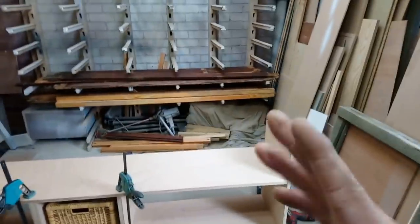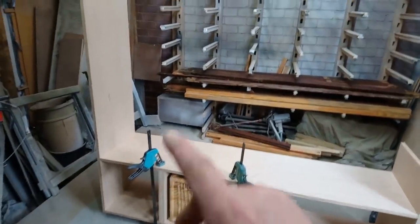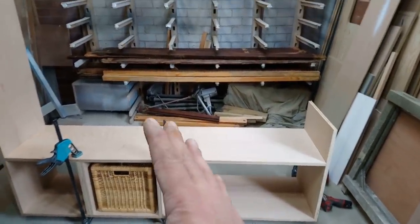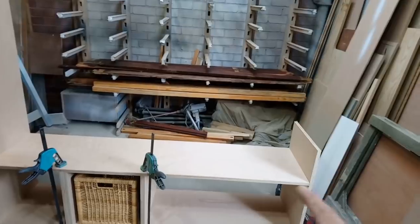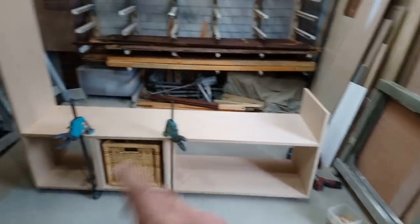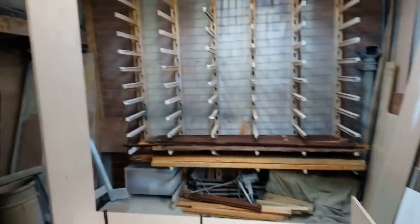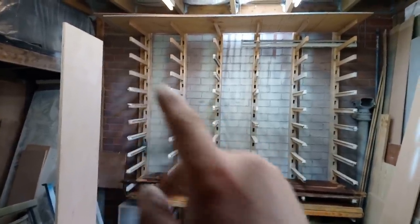Now I've got to work out that diagonal. I could have worked out the angles on the drawing but I think it's best if I build that other shelf unit that's going to go behind here - it's going to have four of those in it and it'll be pretty much the same but on its edge. So I'll stand that one in and I'll be able to pull that board straight to that unit because it'll have a nice straight cut along one edge. I can then mark straight across - string line it or put a timber on.